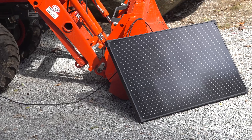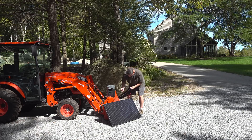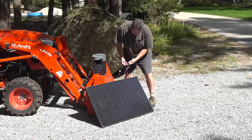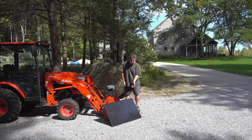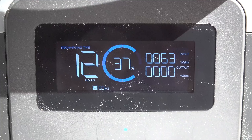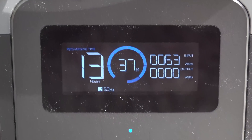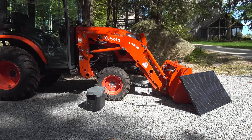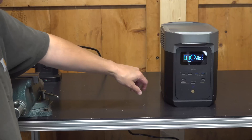You can also charge it via solar. You can use your own solar panels that you already have if they meet the specs that this thing requires, or you can buy a model directly from EcoFlow, and then that cord goes directly into the back of the unit. Immediately, once the sun hits the panel, you can see that I'm already getting about 70 watts. Now, that small panel's only capable of 100 watts, but you can also daisy-chain panels for a maximum of up to 500 watts of solar input.